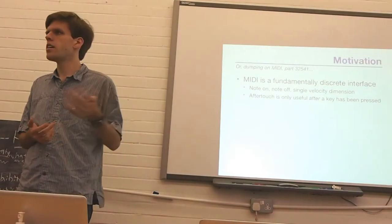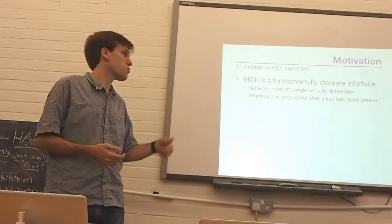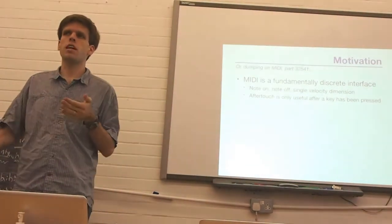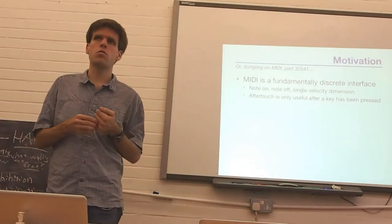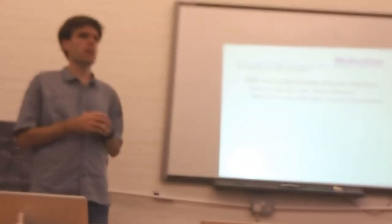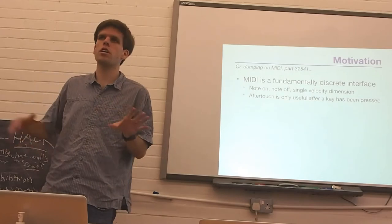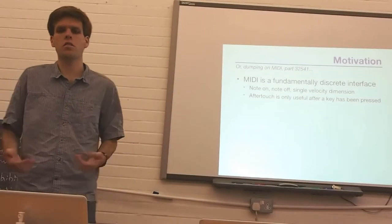Few? Okay. Yeah. So if so, one of the things about the MIDI standard, musical instrument digital interface, is that basically we've got this standard that's been around since about 1983, and it gives you sort of a universal language, I suppose, for controlling different synths. But it fundamentally is discrete. Note on, note off. Just a little bit of aftertouch stuff in the middle, but not a whole lot of ways of shaping a note continuously across its duration.